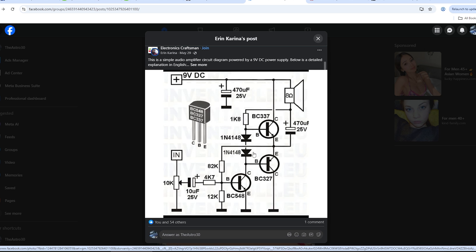The output transistors are self-biased by two 1N4148 signal diodes, like most standard amplifiers, and there's no emitter degeneration here. From personal experience, using BC337 and BC327 as an output stage without emitter degeneration — especially if the supply voltage is higher than 9 volts — these transistors will go into thermal runaway very easily. Thermal runaway is where current starts increasing through the transistor as it heats up, drawing more and more current until the transistor destroys itself, exceeding the safe operating area (SOA) curve.